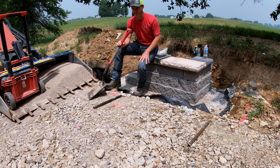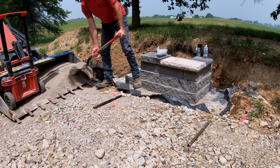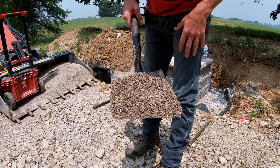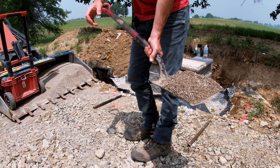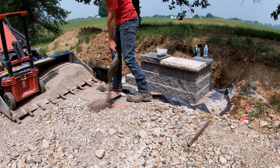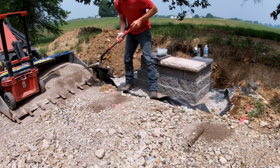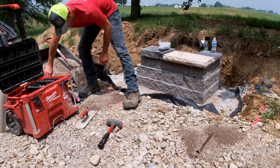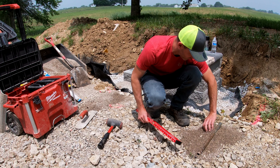We would set these with lasers or whatever. We're going to have our bedding material, and you can do this on open graded stone, clean stone, whatever the case is — dense grade, open grade, whatever. These setting bars — we're going to use this number nine stone. Old Versilock specs would even say sand was acceptable, but this number nine or number eight chip — these nines are really nice to use. Number 89 is a combination of eights and nines, limestone or granite, whatever you've got in your area. No dust, no nothing — it shouldn't compact in your hand, it just stays put and it's angular. So we're going to bed these screed bars real quick, either using a laser or a level, whatever, to tell us where all these things are at.